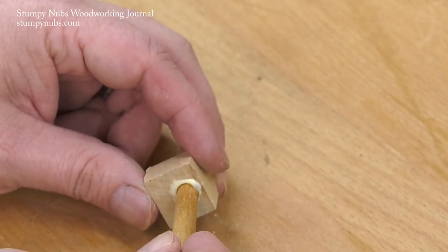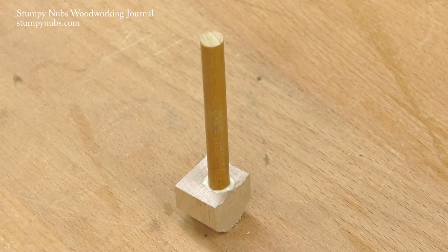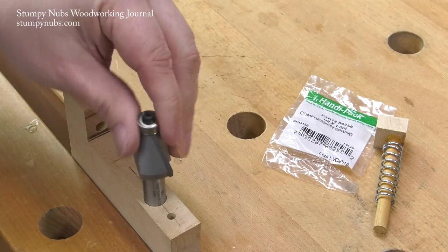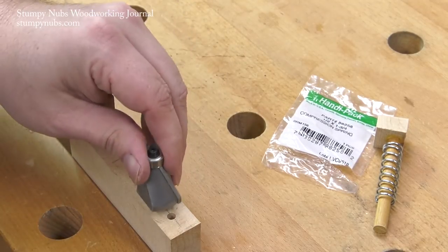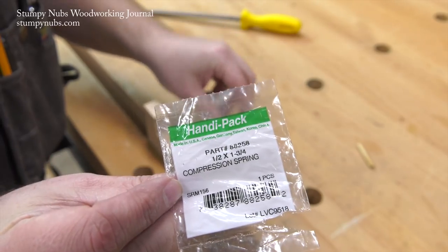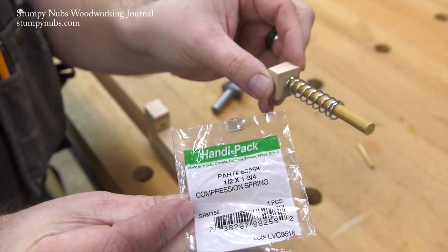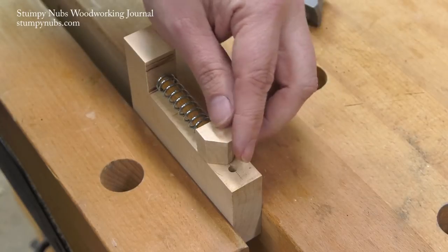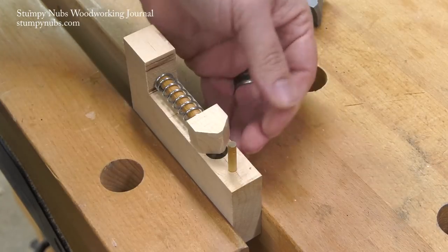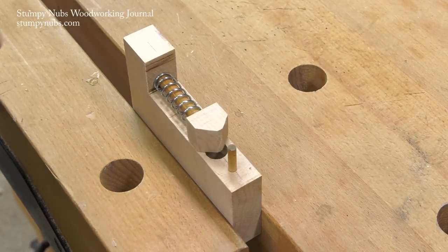At the bench, glue a three inch long piece of five sixteenth dowel into the hole in that little cube. On the main block, use a file in the half inch hole so that your router bit will slide in and out easily without getting stuck. Once the glue is dry, slip a spring over the dowel — I used a half inch by inch and three quarter compression spring, which you can get at hardware stores. Slip the dowel into the hole on the block, then slip an inch and a half long piece of three sixteenth dowel into the small hole on the edge. This little pin keeps the whole thing together and gives you extra support for larger bits.